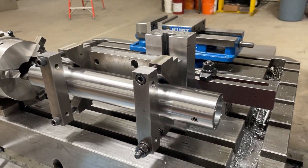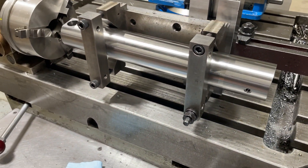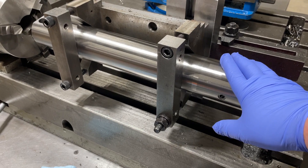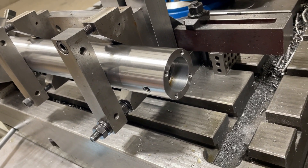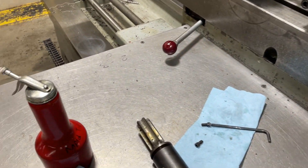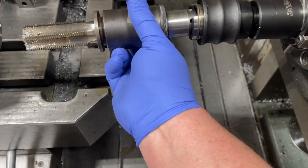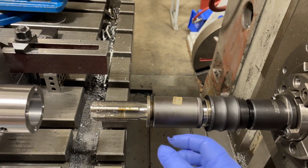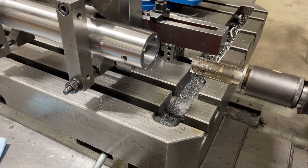This is the part that the nut will actually be bolted to when it's in the assembly. I had just machined all these parts and I still had the setup on the boring mill, so I thought I'd just use one of the parts as a bit of fixturing to hold the nut. I'll put the nut in here and bolt it — just catch it with two bolts because it's a bit faster. Then I've got this tap, the one and a quarter twelve, and it goes in this tap holder, tap driver — easy to do with one hand. And then I can just feed it in and back it out.